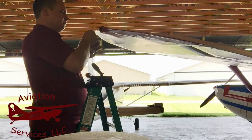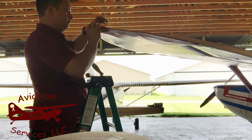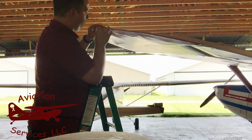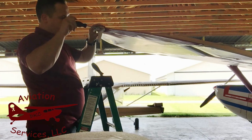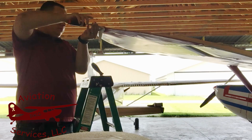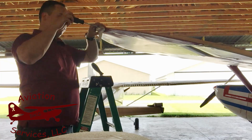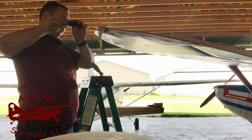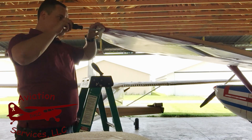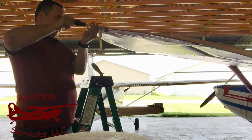I gently tuck the wires into the wingtip and line up the holes on the skybeacon to attach it to the wingtip. I tighten the mounting screws that hold the skybeacon to the wingtip, being careful not to over tighten, which could crack the skybeacon or strip the threads out of the riv nuts that hold it to the wingtip.